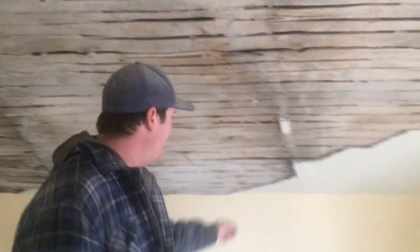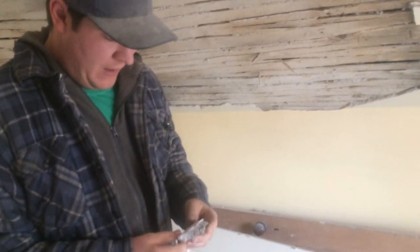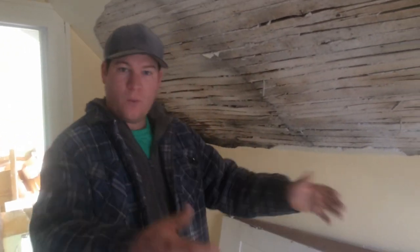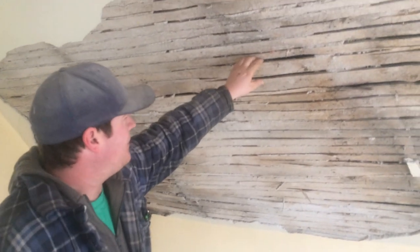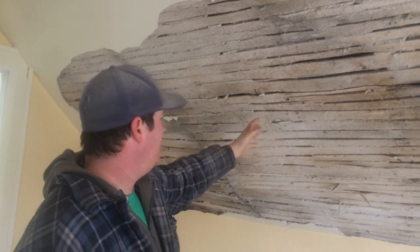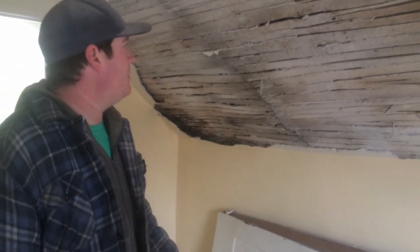So you can see here what we're doing is taking all this lath and plaster off. It crumbles away pretty quick, and the fact that it does crumble makes it hard to clean up — the floor is just littered with it. We'll have to come up with a chute into a dumpster, maybe out of one of the windows with a wooden chute to slide everything out once our dumpster arrives. You can see the old lath, all the wood — they basically nail it solid right to the rafters. Definitely not a common building pattern today.